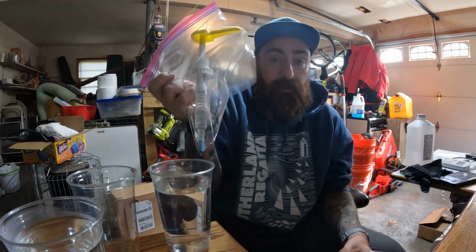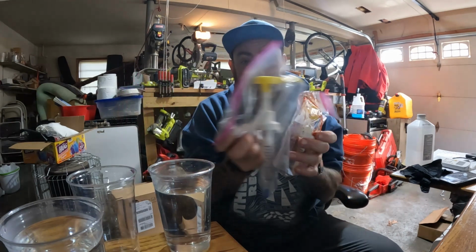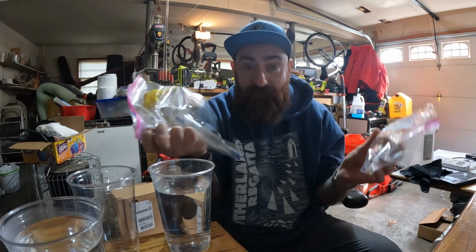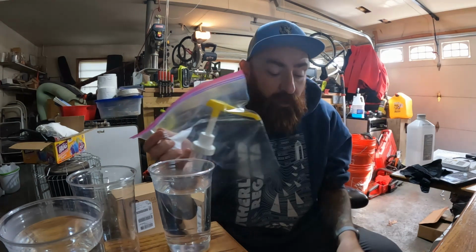If you're doing your glass at home or in a location where you have your pumps and you're perfectly fine, you can clean them there on site. For me, everything I do is remote, so I bring everything home. And what I do is I put my big pump in a big plastic bag, separate from my hardener pump. Why do we do this? Right? We don't want them to be in the same bag and a hardener get on the leftover resin, and then that's kaput. So I always individually bag them.